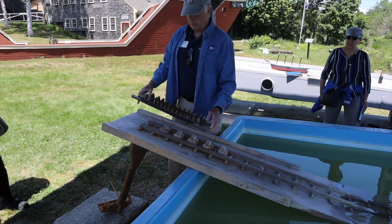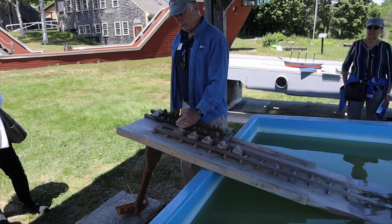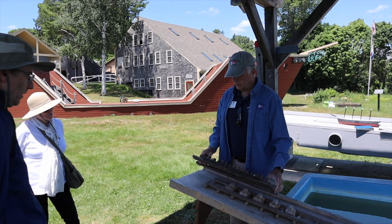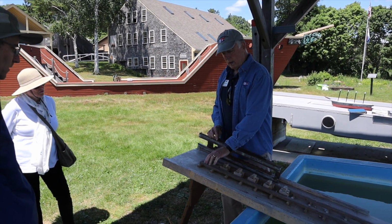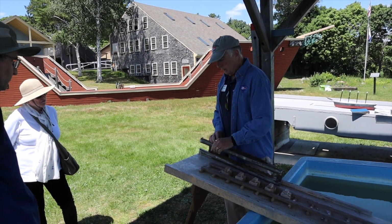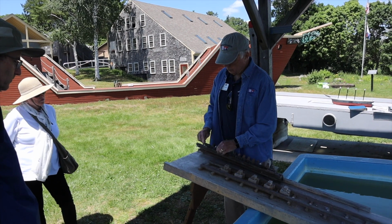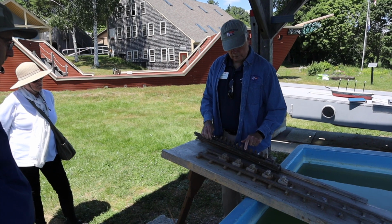We are coming up to about 3 to 4 weeks before a launch date. Remember, the bottom of the vessel is about 5 feet off the ground. So they begin constructing a cradle assembly. It looks something like this. The bottom beam, the one that rides on the standing way, is called the slipper beam. The upper beam, the one that holds these shaped members, would be called the cradle beam. And between the two beams is a whole series of individual wooden wedges.